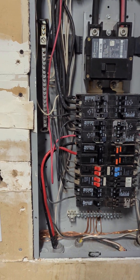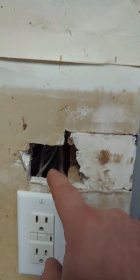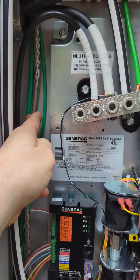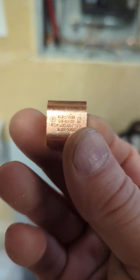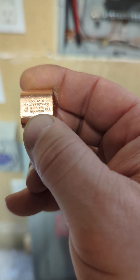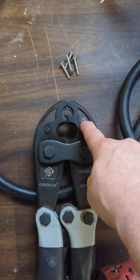The original water pipe bonds, grounding electrodes, and your ground rods — which had a number six conductor coming in — have to be transferred out to the ATS. This is where this number four conductor came up and over; it's in the back and hard to see. It comes over here, and I intercepted the existing grounding electrodes and relocated them to the outside ATS. I like to use grounding C-crimps, and they will tell you the size of the tap and the run conductors that you can use. I utilize a good old faithful Greenlee. These C-crimps are good for the BG die or an O die.